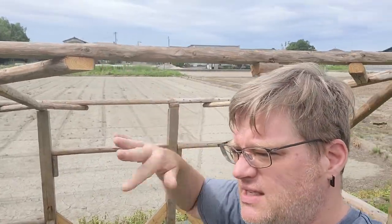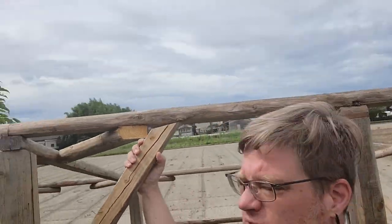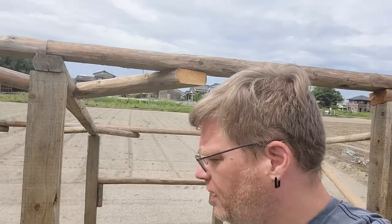I thought I was gonna have to set two different angles or figure it all out. Thankfully, that's not the case. Just one cut in the middle sets it for both directions, and then you just gotta reset it to be straight up and down 90 and cut the 45s on the ends, and I'll be good to go. It'll be pretty quick, which is good.